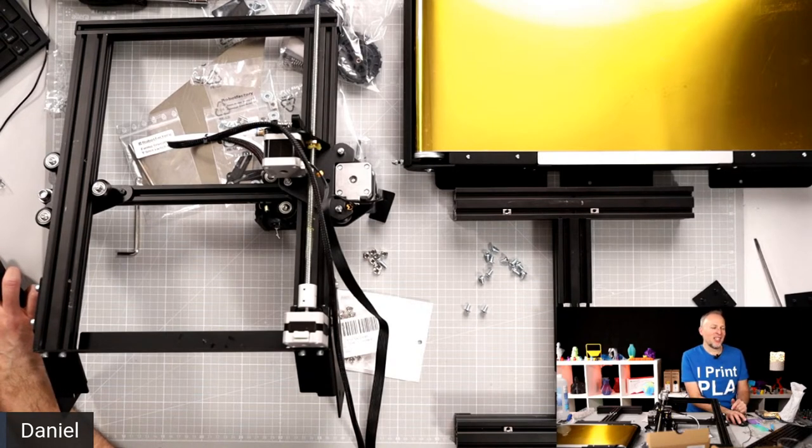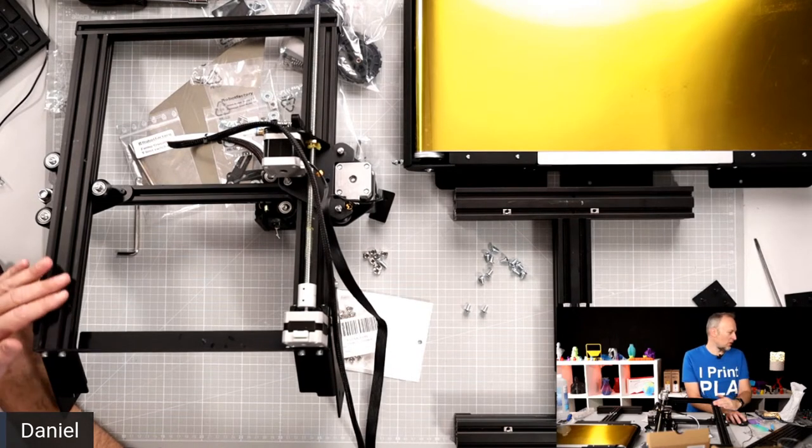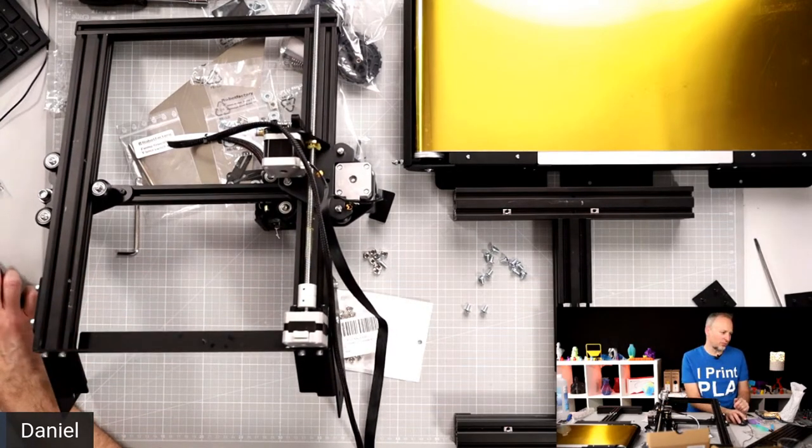It's all my fault. So we have fixed this bracket to the original printer frame, the original y-axis. After aligning the top edge with the profile, tighten the relevant screws. This looks good. This seems to be in the right place. Remember to tighten on the motor side the screw that will serve as a reference for the position of the y-axis limit switch.